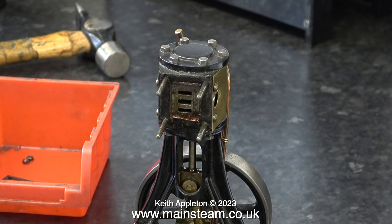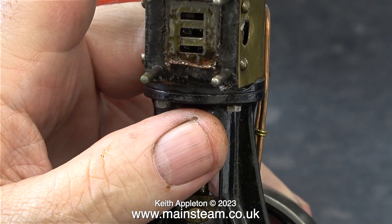This is the universal problem with cast iron steam engines — they go rusty. After a steam run it is really important to blow out all the water, put some WD-40 in its place, and also add some oil to the cylinder or any of the cast iron parts. Otherwise the internal parts of your engine will look like this, or maybe even worse.